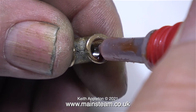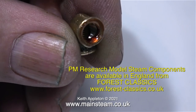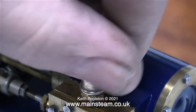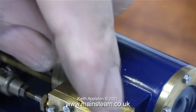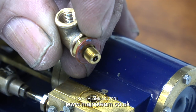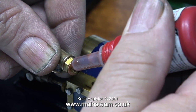This item that I've just been working on — I've actually been re-threading it — is a PM Research 90-degree cast elbow. I always have to use a quarter-by-40 threads-per-inch tap to re-thread these elbows because the threads are too tight. I would assume this is because the American standard of quarter-by-40 is probably different from the British one.